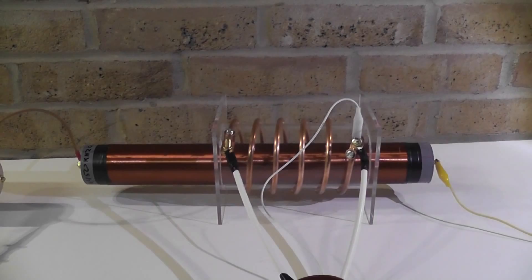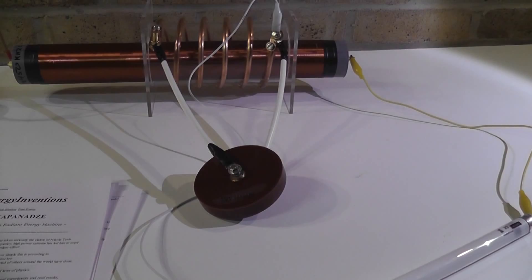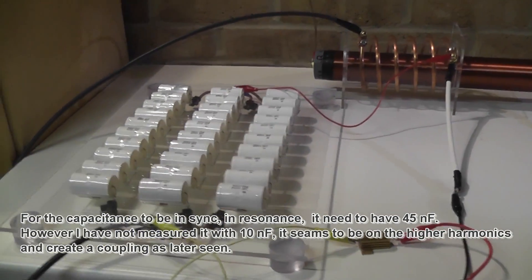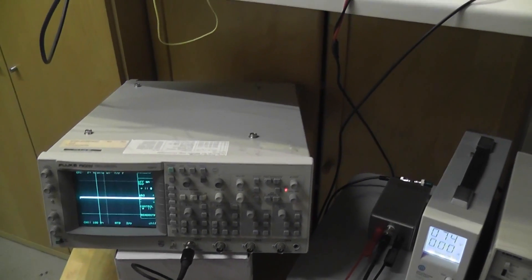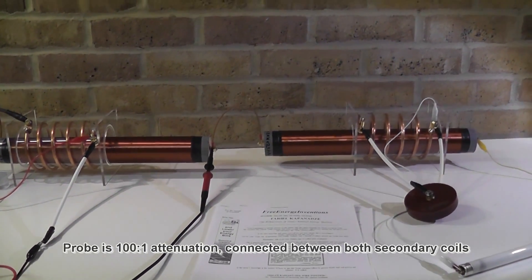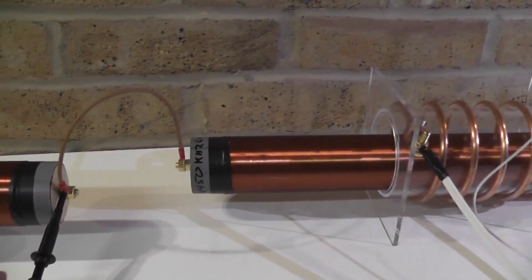This side is identical but clockwise. Here I have a 10 nF 20 kV capacitor, and this one is not — I repeat — is not in sync with the one on the driver side. Here I use 45 nF. I have to use a little resistor because it draws quite a lot of current. I connect the oscilloscope in the middle to see the voltage gain on the front of the two counter-running electrical currents. So you have literally counterclockwise running here, and on this one you have clockwise running, and they are hitting each other here. So I measure that here.